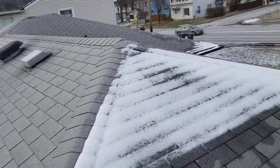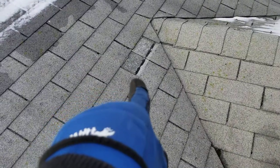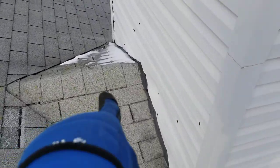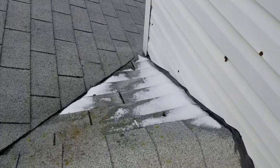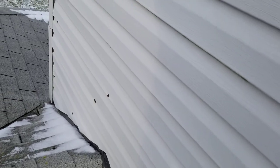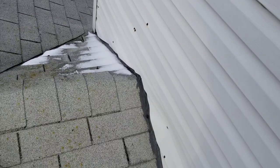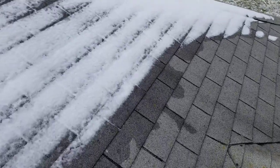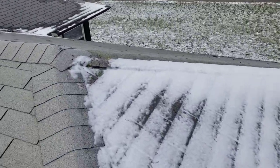Up on the roof, there are some blow-offs — water is coming in underneath the shingles. We've got some nail pops; you can see the nails sticking up off the roof. Somebody did some face nails and face screws on this siding and tried to tie the chimney saddle to the siding, so we've got to address that.